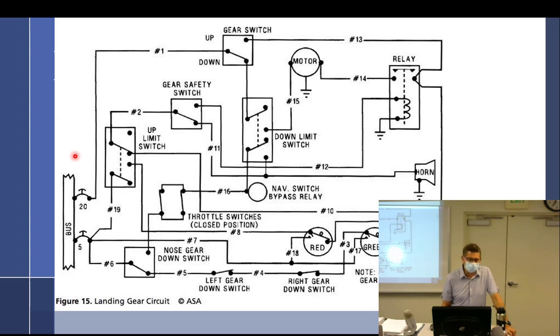And the reason why is because if there's a wire and then the circuit breaker, if anything happens to that wire and it catches on fire, there's nothing to stop it. You got to turn off the aircraft master. So it's really common to see, I know all the Cessnas do that. They just screw right to this bus bar. And what is this bus bar? My 182 looks like they picked up a piece of aluminum out of the scrap bin and just drilled some holes in it. That's all it is.